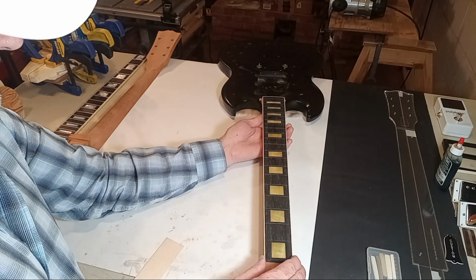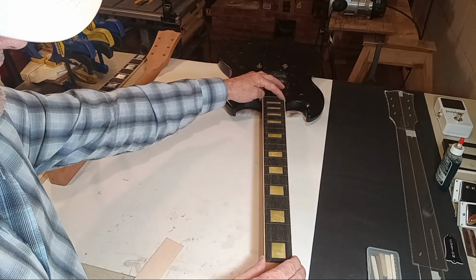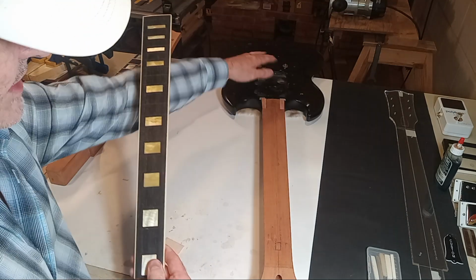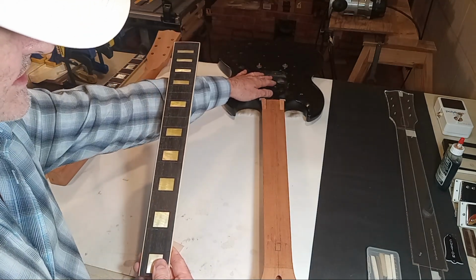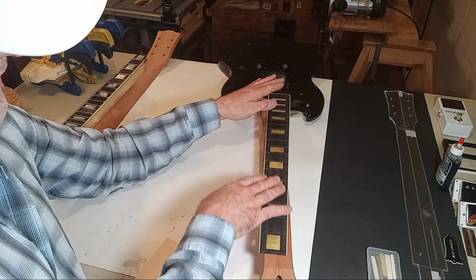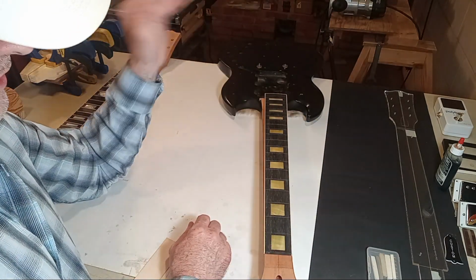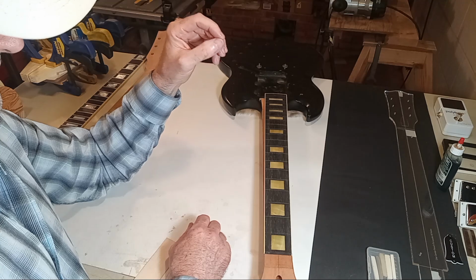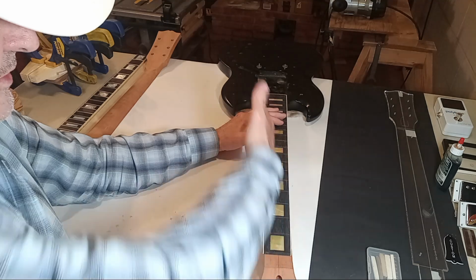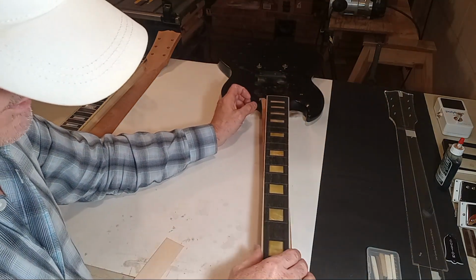If you're having to move a 32nd of an inch, that's getting pretty extreme, because if you're moving a 32nd of an inch here, man, you're swinging quite a bit in order to travel 24 3/4 inches, if that makes sense. That ought to make perfect sense. Just over the whole rise over run thing. The more it runs, the more the rise increases, and the longer that run is, the less rise is required. And this would be the run, and this would be the rise. So it's just basic geometry, of course.